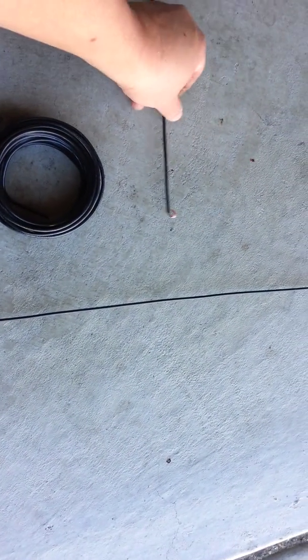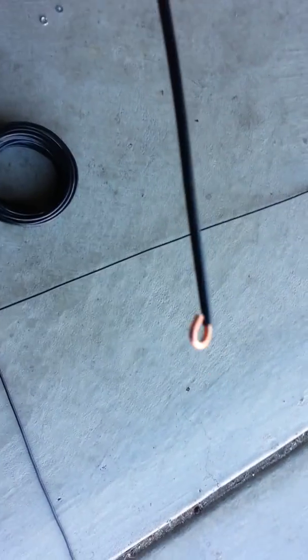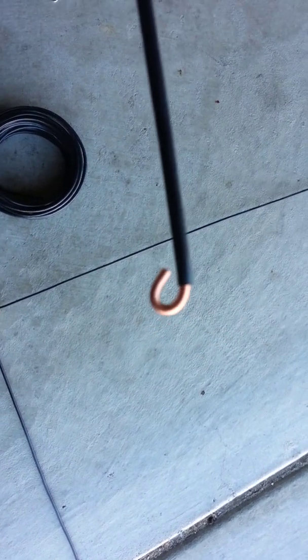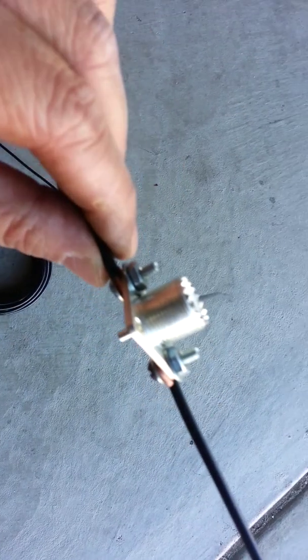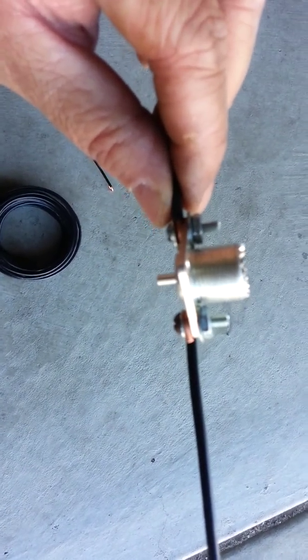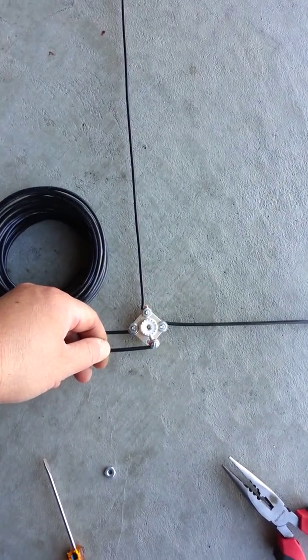I cut 5 elements of 20 inches each. So you cut 5 wires and make a little hook at the end. This is where they go — run the screw through the eye like that, and then fasten it to your SO239.